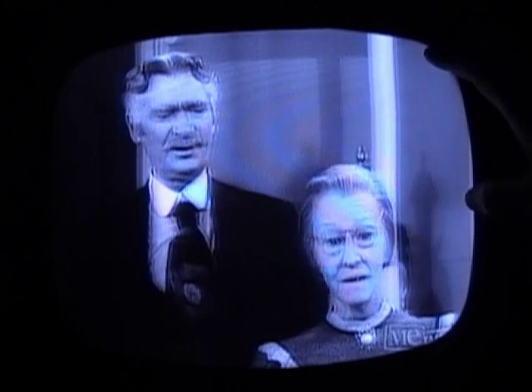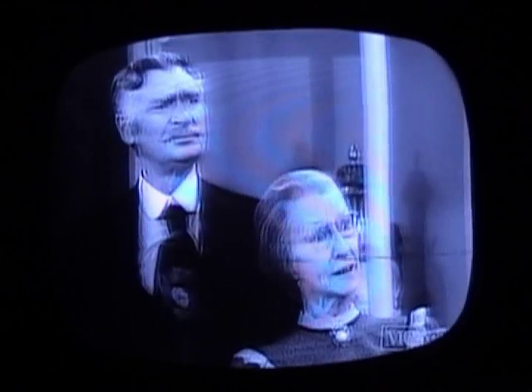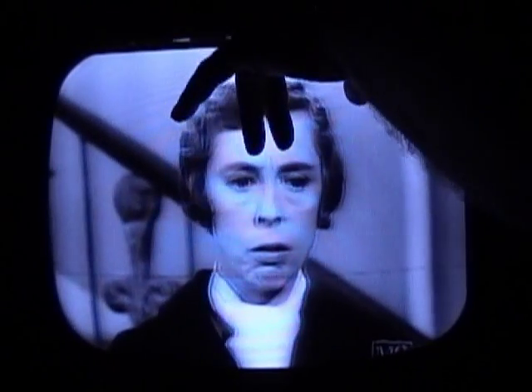I think I'm just about done tweaking this set. The last thing I want to do — there's a bit of a shadow in the upper right corner and the screen is just barely at the right edge. In other words, the whole thing has kind of shifted over to the left more than I'd like. I've been playing around with this centering control, and it's also down a bit from the top. If I get it all the way to the right there's a gap at the top, and if I get it all the way up at the top, then there's a shadow on the right-hand side — so I've been fighting with that.